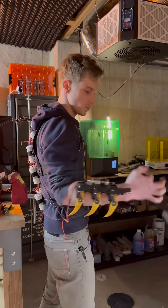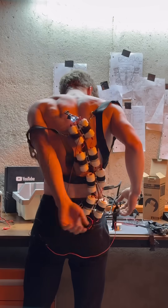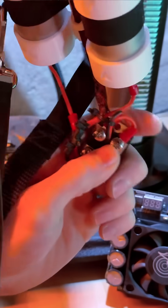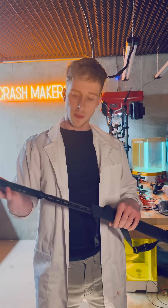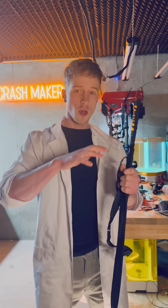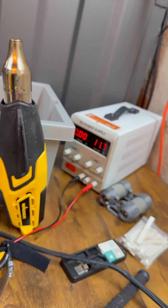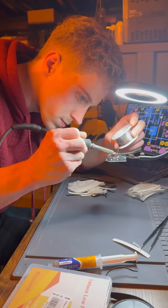My old spinal battery, while still having the ability to divert power when damaged, is not ultra efficient due to the dual automotive power diode I have on there, which performs cell isolation. This prevents reverse flow from lower voltage cells, or even a blade cutting through it and shorting out the controls above it — isolating all damage so the system continues running. However, all real diodes have a voltage drop, meaning the more power you pull from them, the more power they dissipate and waste.